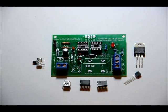You just have to gently line up all of the leads to the holes. Might take a second. You have to have some patience and just wiggle it in, and it fits nicely down under the board. Make sure it's flush. Very, very fine leads, so use a fine tip soldering iron. Make sure there's no shorts.